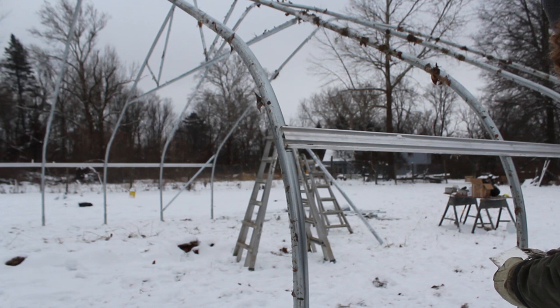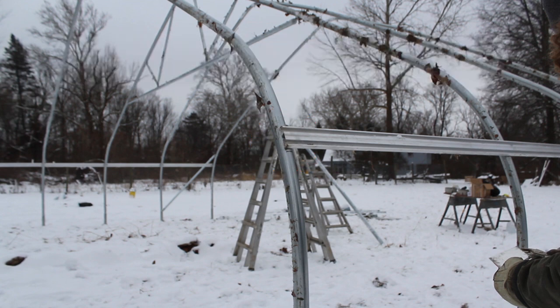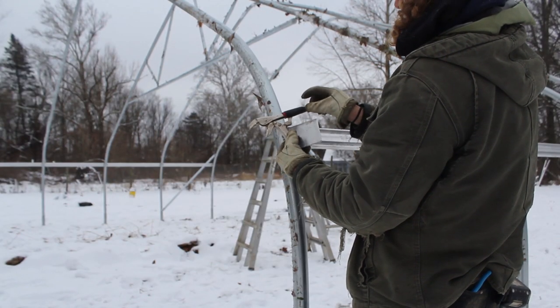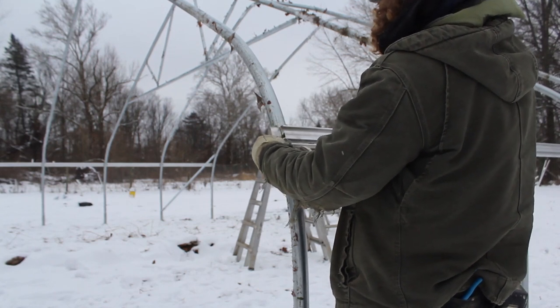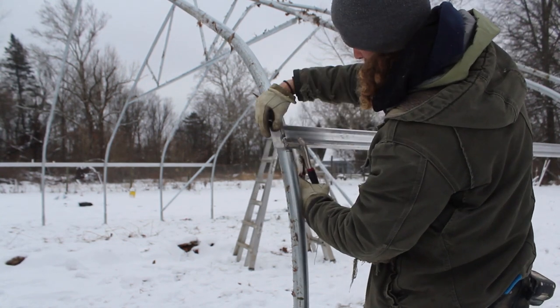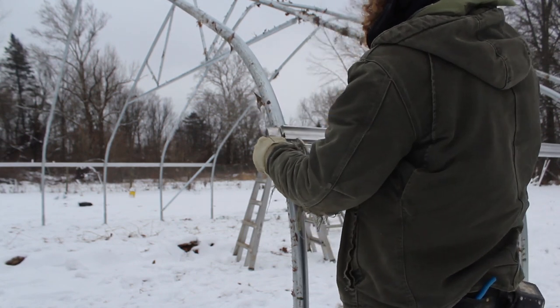Eventually you're going to need to connect a new piece of double channel to the piece you just installed. Where two pieces of double channel meet, they must be connected with a splice plate. Because the splice plate covers the slots on the back side of the double channel where the two pieces meet, there's no two-hole strap securement here — instead, they're screwed to the hoops and to the plate themselves. Adjust your vise grips so that they can hold the splice plate to the back of the double channel. You'll definitely want to use vise grips here so that the plate doesn't spin when you're attaching with screws — if it hits your knuckle, it's going to take your knuckle off when it's spinning.